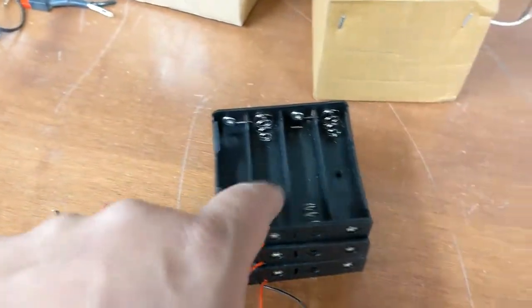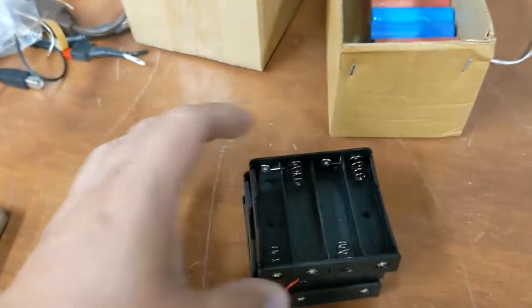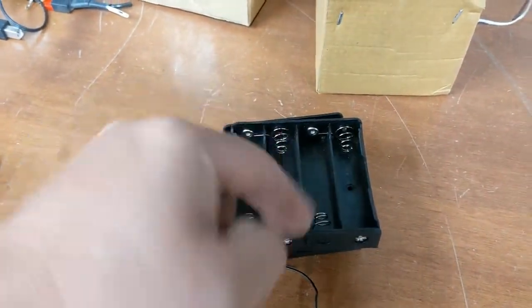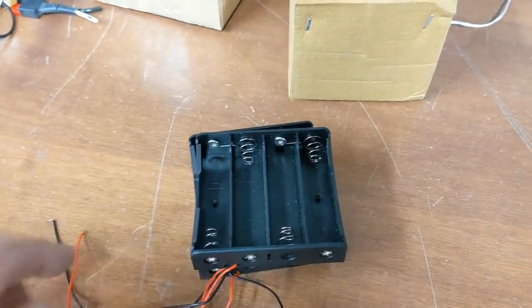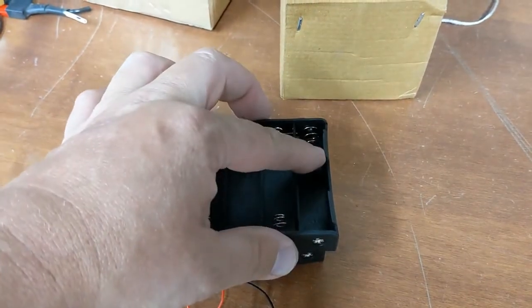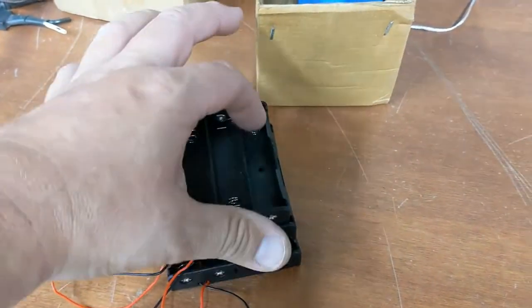I can't use all 4 connected together, so I'll have to connect onto the spring of a thing here and pull a voltage off of that. So you got negative that starts at this end here, boop, boop, boop, boop, boop. Gets you to 11.1 volts right here. So I'm not gonna put a battery in here. I'll cut that little wire, but then there's 1 extra space.